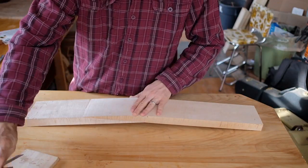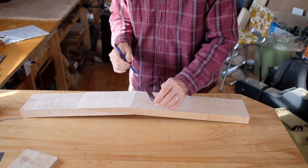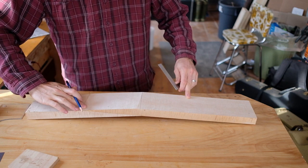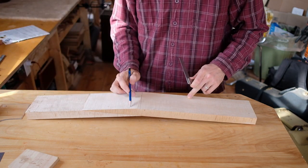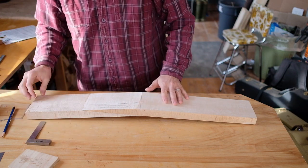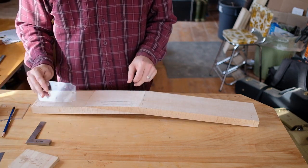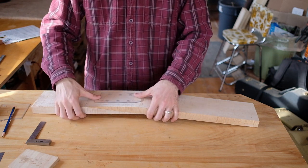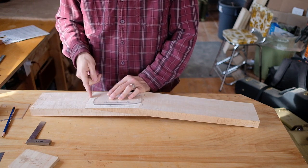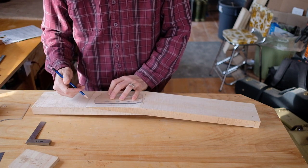We're almost there with this one. As you can see, it's actually a little bit angled here — you can tell because there's a bit of a ledge lip on one side but not the other. So this has to get sanded down a bit more on one side. I don't want to have to sand this whole area flat, so I'll figure out how far I need before I cut it off. It looks like I have plenty of extra space, so I'll cut right around the end of the scarf joint — that'll give me lots to play with.